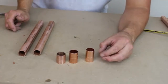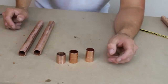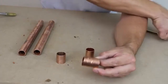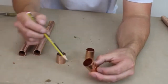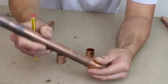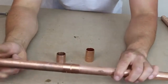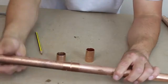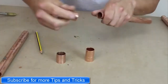Here we have three 22mm straight couplings, but they're all slightly different. The standard straight coupling is this one here, and the way it works is that it has this center ring around it, which is the halfway point for the pipe to be inserted in. This means that when we put another piece of pipe in, both pipes are in the fitting at an equal distance. So that's the standard or normal straight coupling.